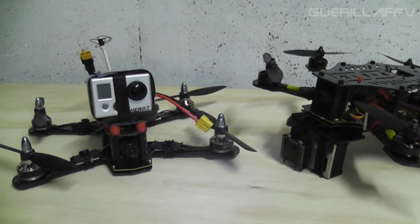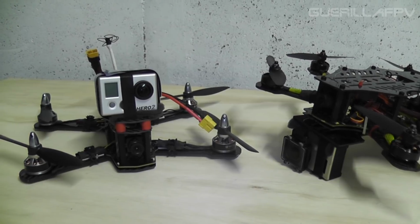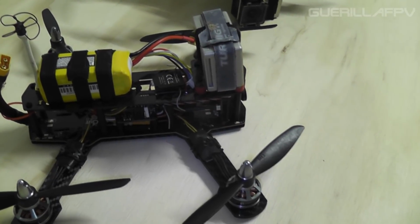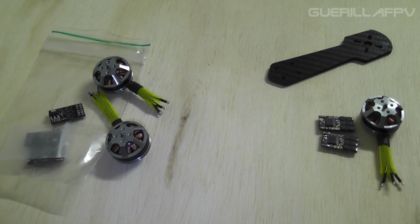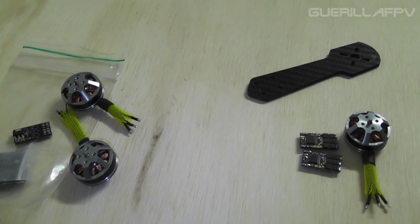I guess the standard definition is 4S battery with motors that can support a higher ESC and then 6-inch props. I've gone with the KISS 18A ESCs, which I had a really difficult time with. I've gone through a number of them, probably about 7 or so on the build. The 2 companies I was getting the ESCs from were viacopter.eu and Flyduino, who are both great as far as technical support or even replacing them.